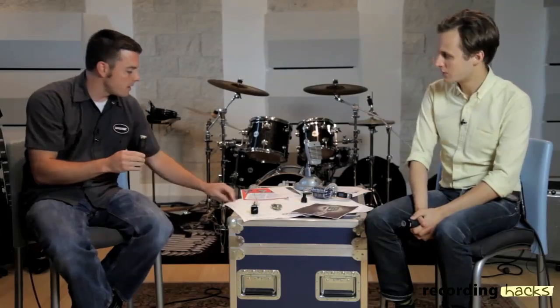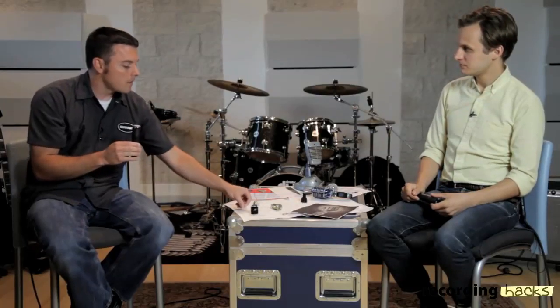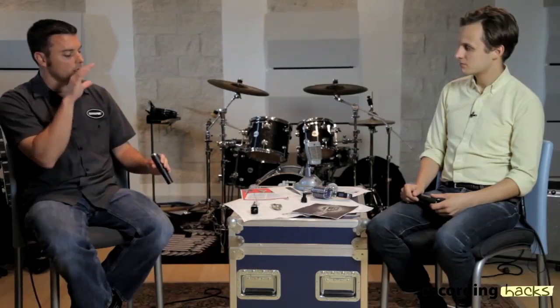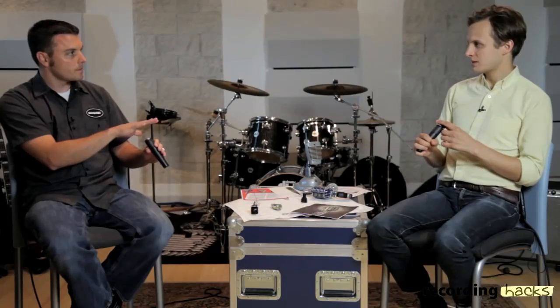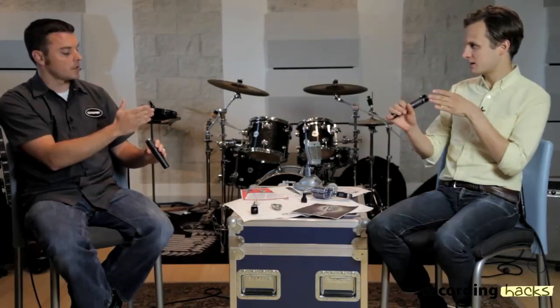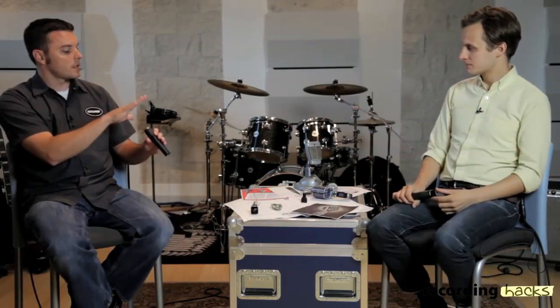We then restrict the sound using a resistance cloth, which we talked about. So what we do is we allow the sound to get delayed using a resistance. And so when you create a directional microphone, you speak on axis of the microphone. You get all the sound entering the front. So let's just say 0 degrees axis. All the sound is entering the front and vibrating that diaphragm.